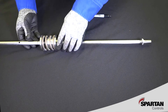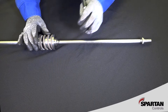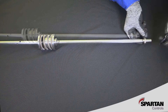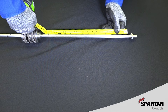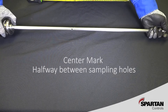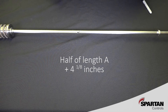Reinstall the outer components onto the tube so that the end positions are aligned with their respective marks. Mark the inner positions of the packing gland and the front ferrule on the sample tube. Measure the distance between the two new inner markings, which should be approximately the outer diameter of the exhaust pipe — we'll call this Length Measurement A. Place a center mark on the sample tube halfway between the sampling holes. On one side of the tube, create a mark that is half of Length A, plus four and one-eighth inches.